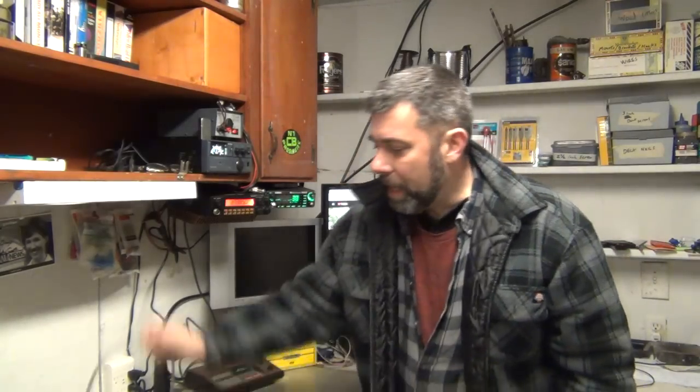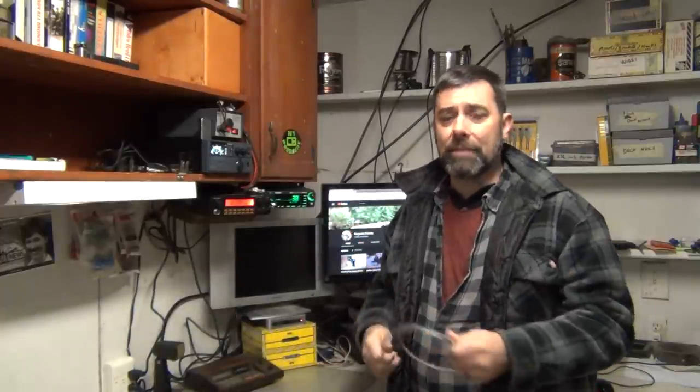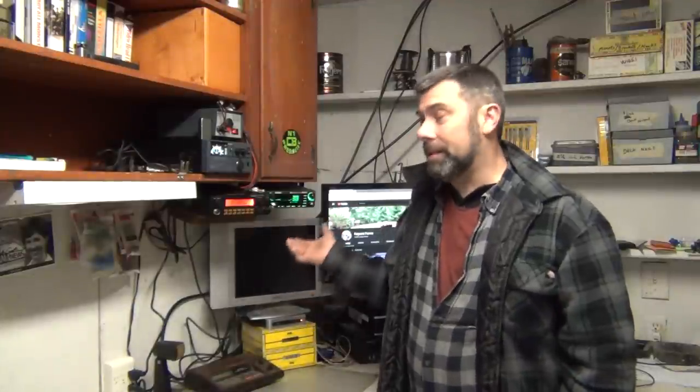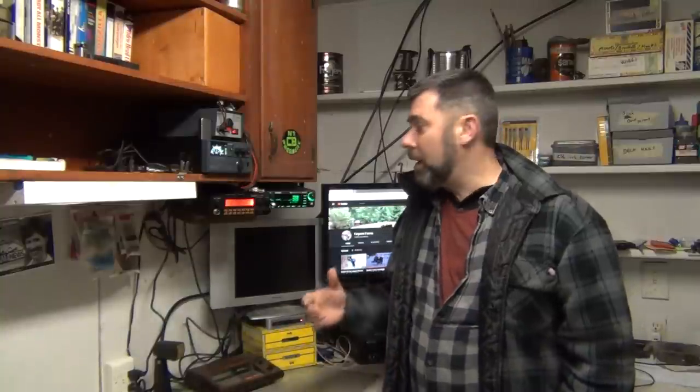I want to be clear as to why you're spending the money. A hundred feet of quality cabling like RG213 is going to cost you around $75–$100. When you're spending $65 for an Antron A99 and then $100 on cabling, that seems crazy — but I'm telling you, you could have a $500 antenna on the roof and if it's hooked to your radio with $50 worth of cheapo cabling, you're not going to get the best performance. You'll get interference, a lot of background noise, and a weak signal. You'll really be missing out.